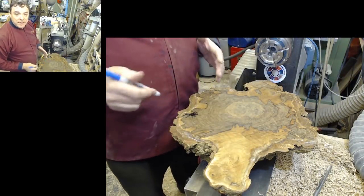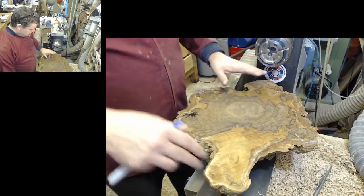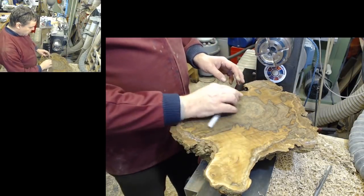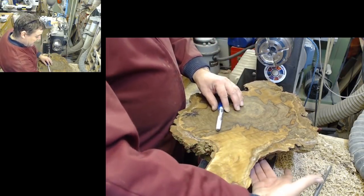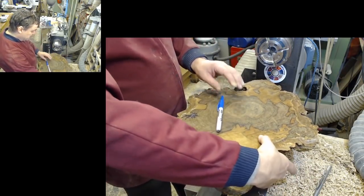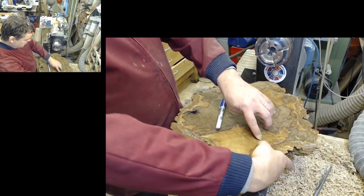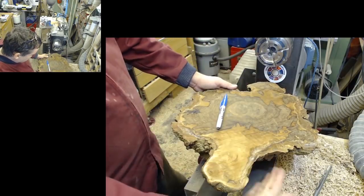Now the job is to find the centre of the bowl for where the face plate is going to go. Obviously I've got a longer distance here than here, and I've also got to think about underneath the bowl as well. It goes quite a way — it's quite thin this part — so that's going to limit the depth or the angle I can put the bowl in because I don't want to break out the side.